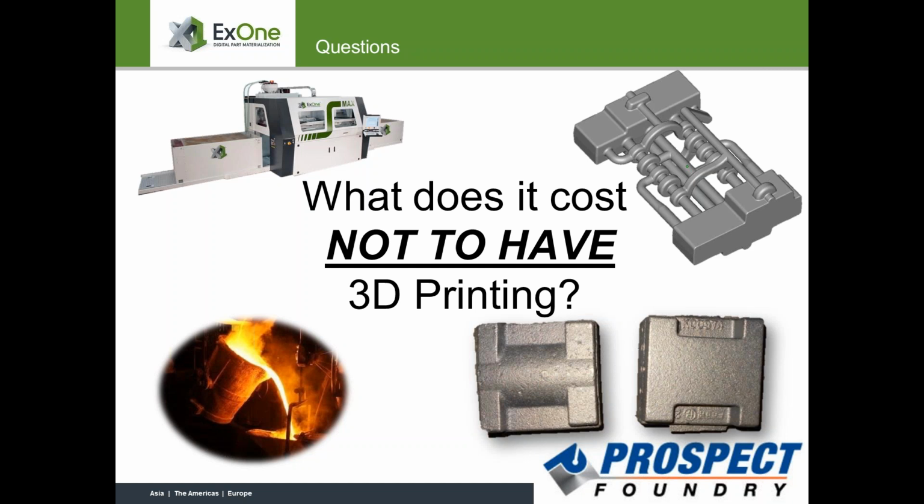Now again, if you're talking about a mold and how big of a mold can be printed, certainly a casting can be 50 feet long, and we can create a combined core structure, a combined 3D puzzle mold, to create a very, very large mold. So generally, we don't see too big of a limit when it comes to size. But certainly, at that point, other processes, whether it's styrofoam or other approaches to produce some patterns, may have cost benefits once you get above a certain size. Nonetheless, there's generally nothing we can't print from a size perspective, but any one piece will be no longer than 70 inches coming from an ExOne adoption center or one of our customers that have a 3D printer.